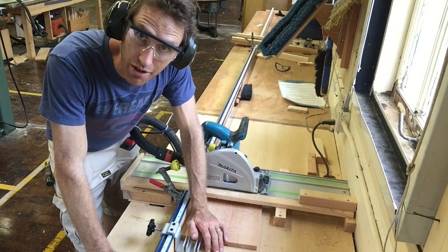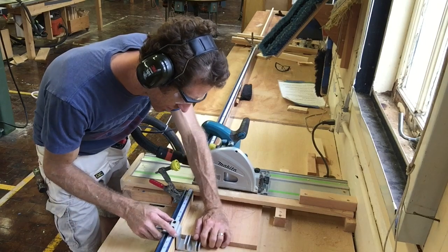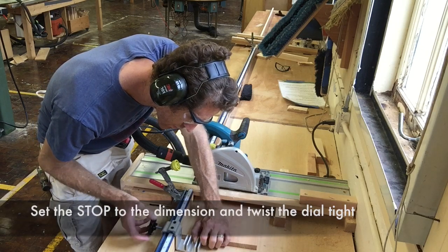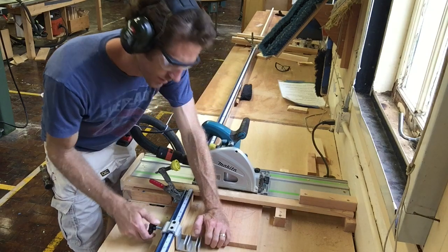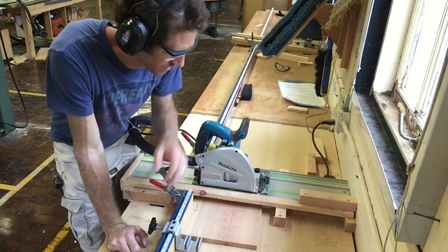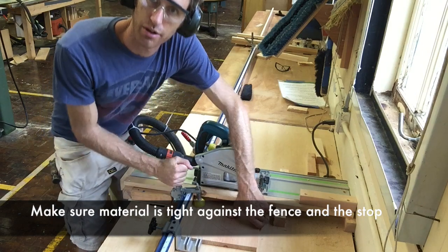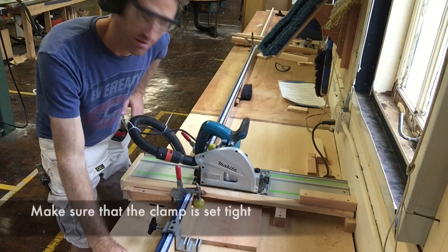I'm going to try and make this into a square. On the band saw I took it to 10.5, and now I'm going to take it to 10.5 on this as well. I'm going to set it to 10.5. Make sure I turn this dial nice and tight — okay, that's not moving anywhere. My stock is set, 10.5 inches. Then I want to make sure my material is slid tight against there, tight against the fence, tight against my stock. Then I can go ahead and lower my clamp. Feels pretty tight.